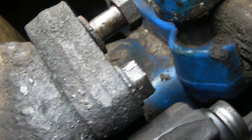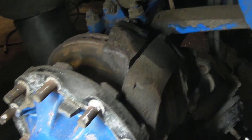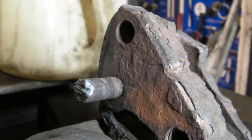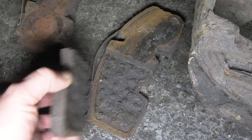This bolt was actually cross-threaded - I couldn't get it out of the caliper carrier. You know how a caliper fits over a disc? I had to pull the disc off with the hub and the caliper all in one go after I'd gassed the head of the bolt off, as you can see here. That is stuck fast. I really don't know why, but we're engineers here - we can get around things.